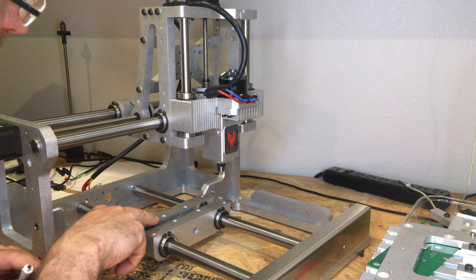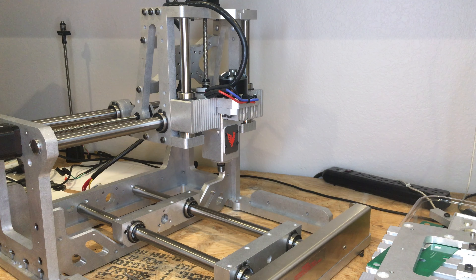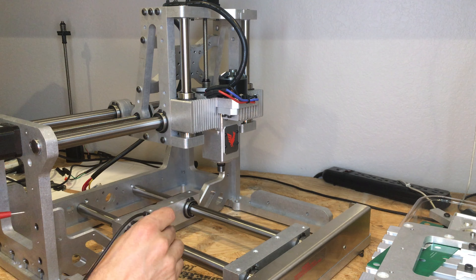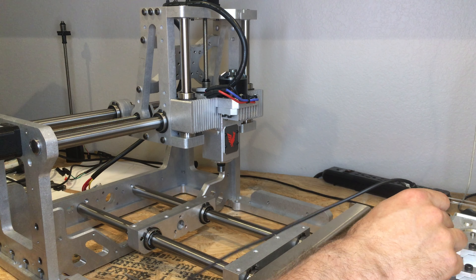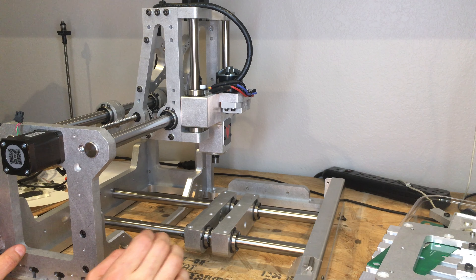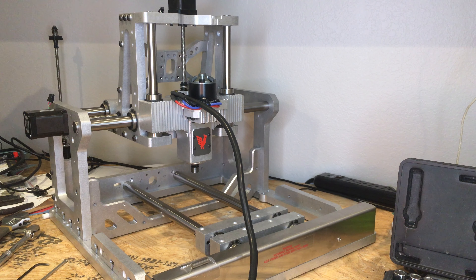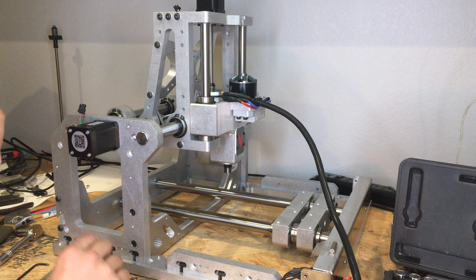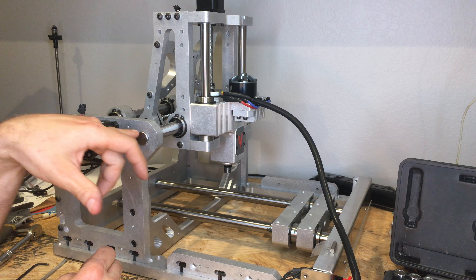Eight bolts — completely unnecessary. These bolts have to be insulated, and sure enough they've got plastic insulating washers. This is just a PCB — 'Back Shim Rev 5.' Why on earth did they need five revisions of that? There's a little plastic collar sleeve — hopefully that doesn't get too hot and melt. All the pieces are slightly different from each other, and those minor differences make this more expensive to manufacture. They're using a standard ball bearing steel for the sensing, and there's only one insulation layer.